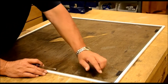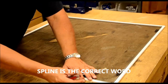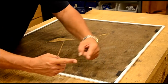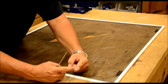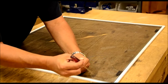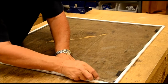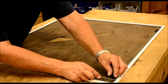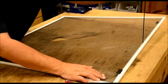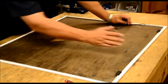In order to rescreen this, there's a rubber beading in a little channel on this frame. Somewhere in one of the corners where the two pieces of beading meet is where you want to start. Get a small screwdriver — anything small enough to get into that channel — and lift that little bead out just enough where you can grab it.